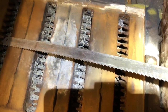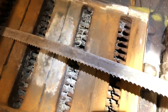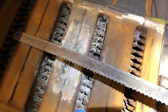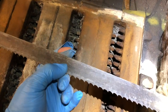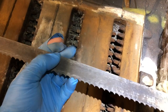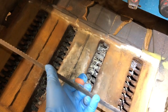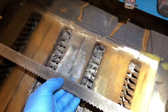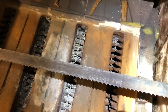So far I've got the top of the heat exchanger vacuumed off and I used a wire brush on the center part — there was soot caked on. This is the soot saw. If you get a soot saw, I recommend getting one that's nice and flexible, that way whenever the piping on the boiler is in the way you're able to flex it to get around it.